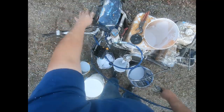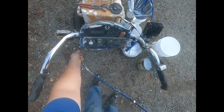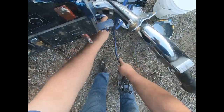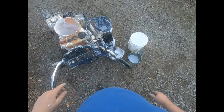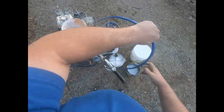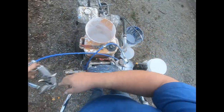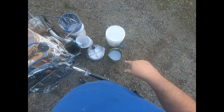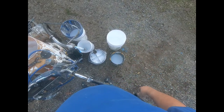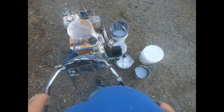Pump off, throttle down, turn it off. This machine is done — it's winterized. All I'm going to do now is park it in the container. Springtime, we'll get an oil change. We'll take off this second hose because that was for a double line job. All the waste water will go back into one bucket, sit in the box, let it settle out. All the solids will sit to the bottom, then we'll just dump the water out in a toilet and throw the solids out in the garbage. That's it, thanks for watching.